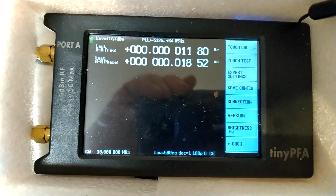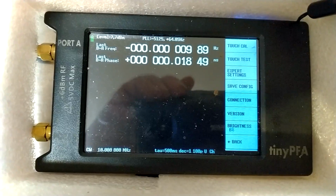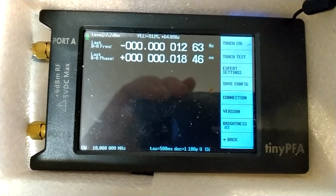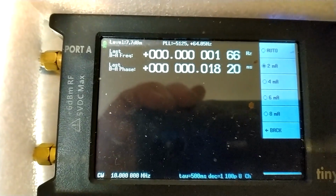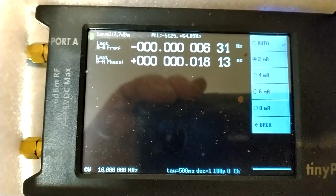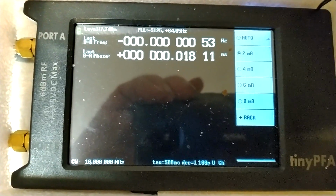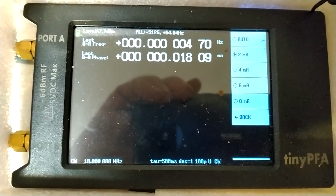The brightness should be set to minimum, and I have switched off the traces on the screen to have it as quiet as possible, because the changes in current in the unit change the phase that it measures. This is important. If power is set to auto, then suddenly it changes between the different levels. I guess it's the charging of the battery. And now and then there is a step function on the recorded phase, and that destroys the Allan deviation. So fixed minimum helps to make the system more stable.